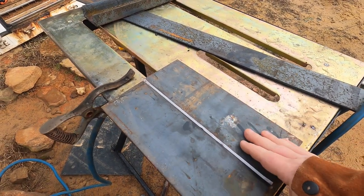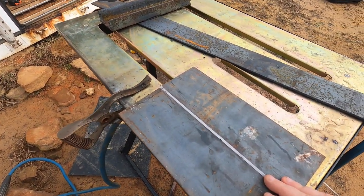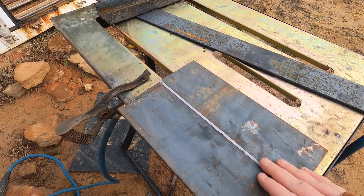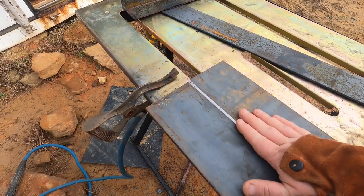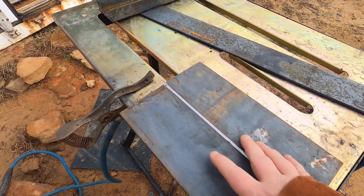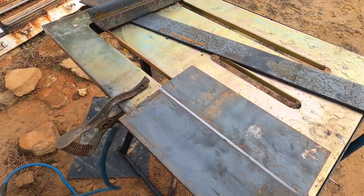Once this is welded together, then what I'll do is I'll grind the weld on one side flat. Actually, I need to grind both sides flat because one side's going to weld to the box and the other side's going to mount flush on the hoist. So I want those flat. So basically, I'm taking two pieces of steel and weld them together to make a big plate.